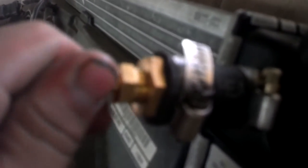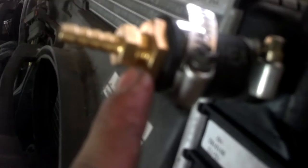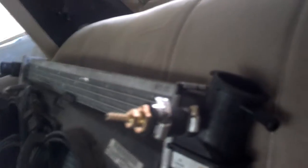This is what I'm gonna run for the steam vent tube line — a little piece of heater hose. This bushing looks like this without the nipple and it's got threads inside, so I just thread that on into the hose, clamp it, then thread this into the bushing, and then put my hose on there and call it a day. That's what I'm gonna do for the steam vent tube.